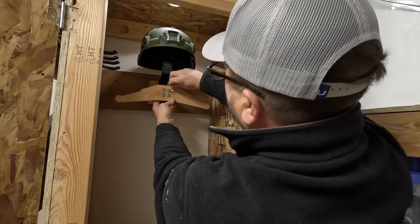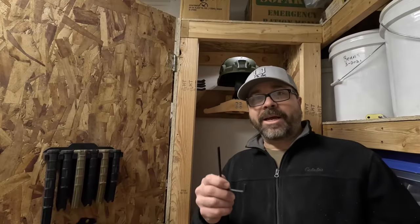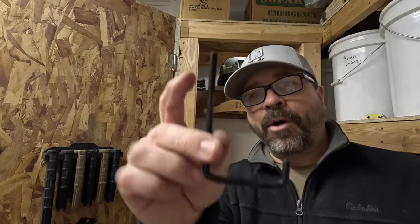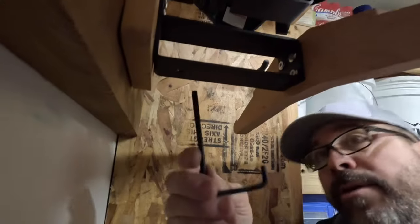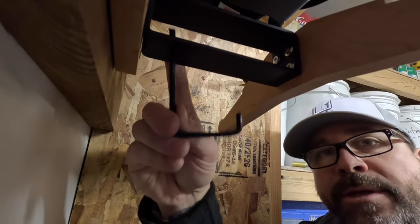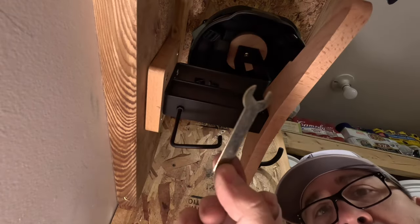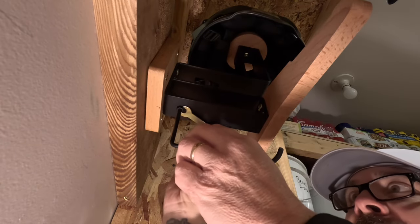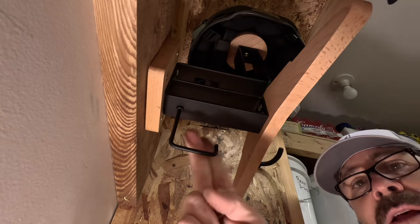The last thing I have to install here is just the belt holder. This consists of a bolt at the top of the hook with two nuts that sandwich it together on the bracket. It goes in this hole right here on the mount, and you can actually adjust the height of it with the nuts. Take this little wrench they provide and just cinch it up like that.